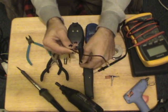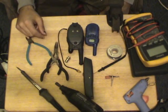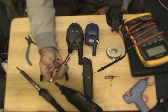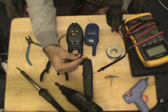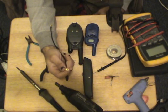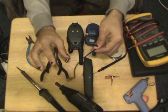This would be the easiest solution if you really wanted to do this. Like I said, they're really easy to get, and they come pre-crimped onto the coax. Now, as always, if you're using coax, you're going to have to use something rated for the frequencies that you're in. LMR 195 that we have been using for Wi-Fi is more than enough. However, it does get a little inflexible. It's kind of rigid. This is actually RG 174.